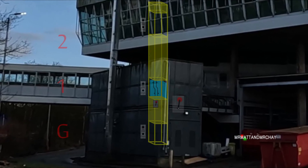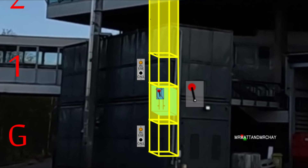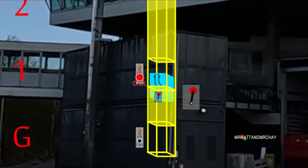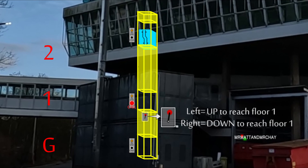The decision is made by this roller switch. The lift moves it to the left when it passes it in the down direction, and pushes it to the right when going up. Therefore, when the switch is left, the lift comes up to reach the middle floor. If the switch is right, then the lift must be above the first floor, and the lift travels down to reach the call.